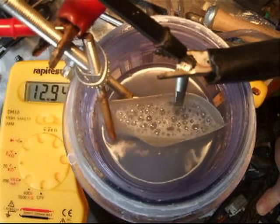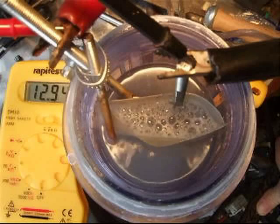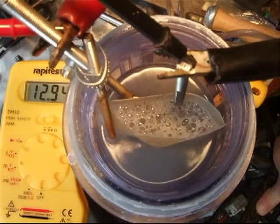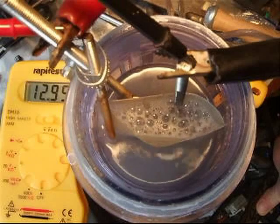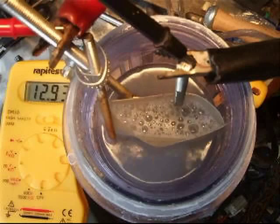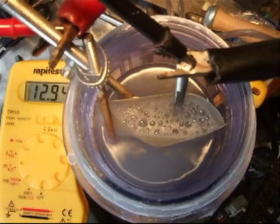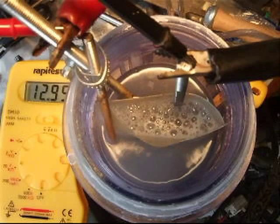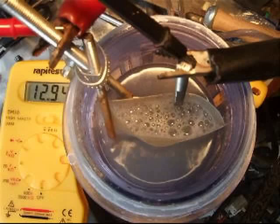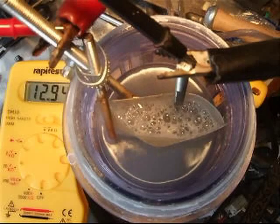You can hear that sound — it's just the fan coming on in my power system. We're not getting a lot of HHO production on this system. It's just an experimental cell. I tested it yesterday and was getting about 50 millilitres per minute, so it takes about 5 minutes to get 250 millilitres — about 20 minutes to get a litre, which is not a lot.